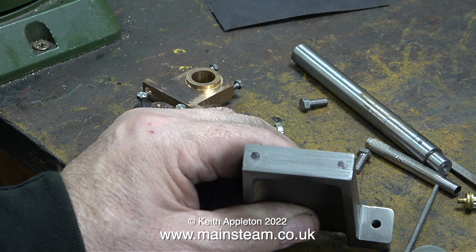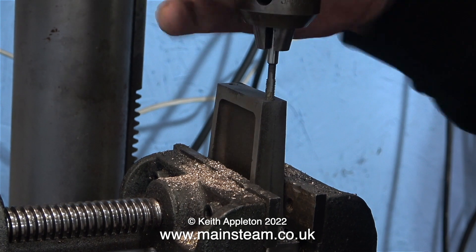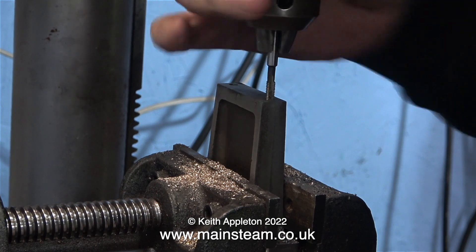To find the position of the holes on the top of the pedestal, I used the deep hole marker through the holes in the bearing, and then scribed around the bearing hole to get a ring inside the black dot. As usual, I started with a centre drill, then used a 5/32-inch diameter drill to drill the holes 3/8 of an inch down into the pedestal. Then I threaded the holes by hand, but still in the drilling machine, to ensure accurate alignment.